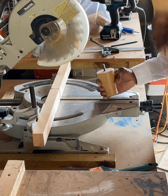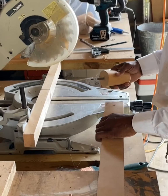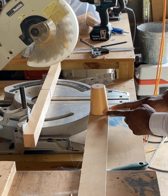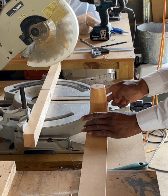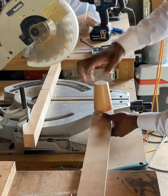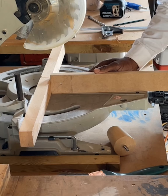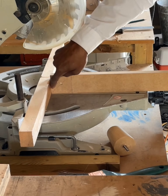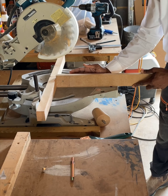What I've decided to do: I've cut a piece of MDF, bit of scrap, cut a hole in the centre of it. I'm going to drop this leg in the centre. I'm going to cut it off — cut this section off — then I'll pin this back onto this. That should allow me to have it like that, at 90 to the chop saw, and then I can just chop through the leg.